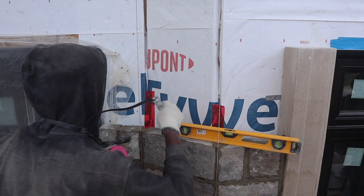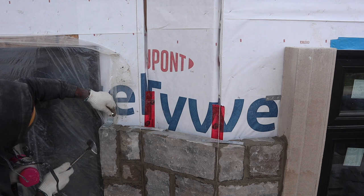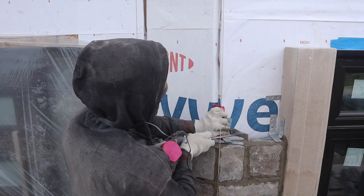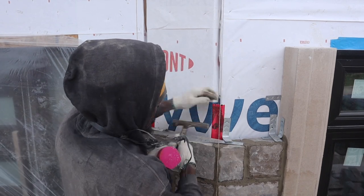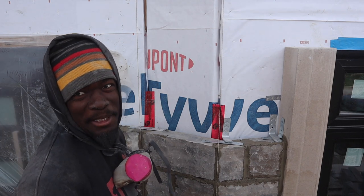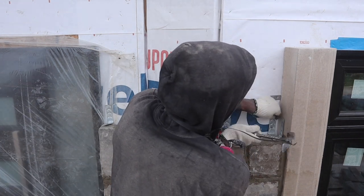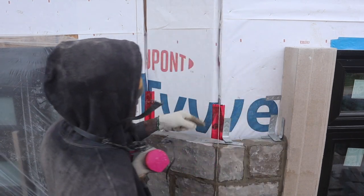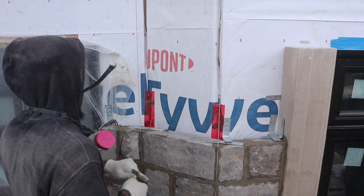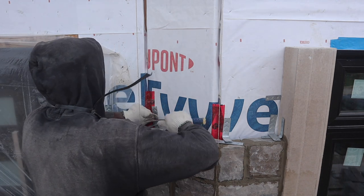Guys, make sure you use a lot of brick ties. See, a man and a rookie do it. Yeah, man. Hey, you good? Yeah, man, keep watching, guys. Soon you will catch on. It's your first time laying man-made stone. I promise you. Make sure you use a lot of brick ties if you're doing a 45 like this. This is a double 45 that we're doing here. We want to make sure we secure it nicely.